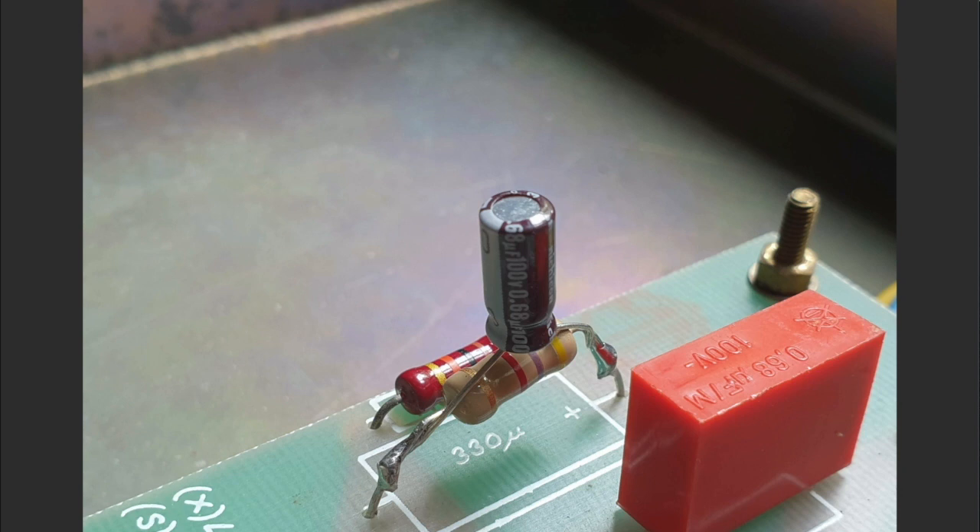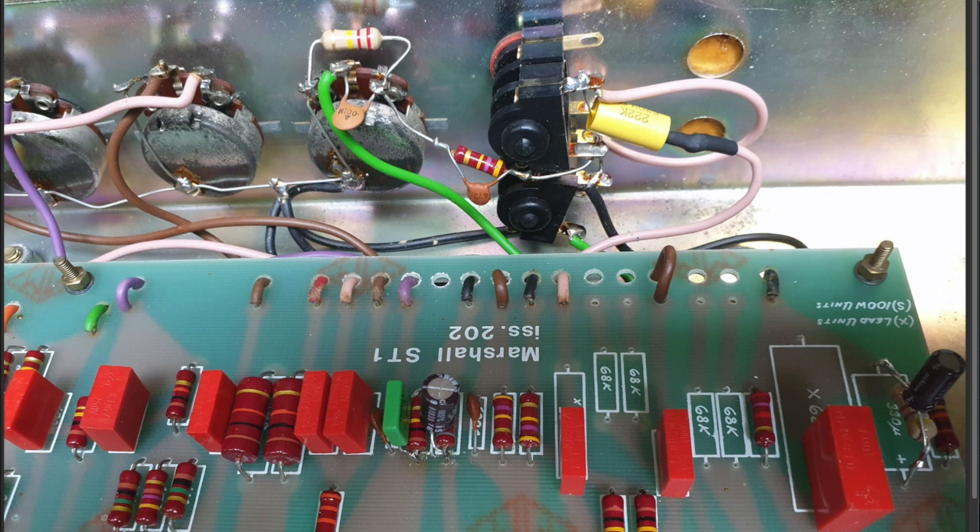Alternatively, if you don't want to lift the board at all, pre-wire the parallel resistor and capacitor arrangement and connect it to the legs of the 10K resistor by soldering onto each leg — it'll have the same effect. Here's also the existing 0.68 microfarad cap on V1B. I'm using an electrolytic cap and prefer the tone of these, but my aim was to keep the mod completely reversible on this 40-plus-year-old amp without taking anything out.